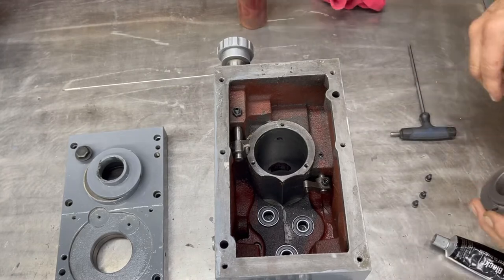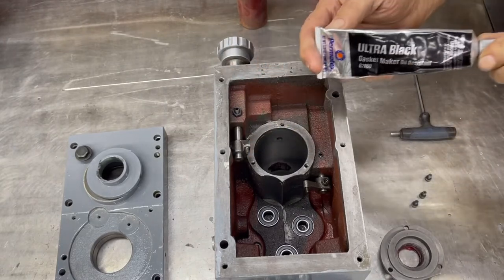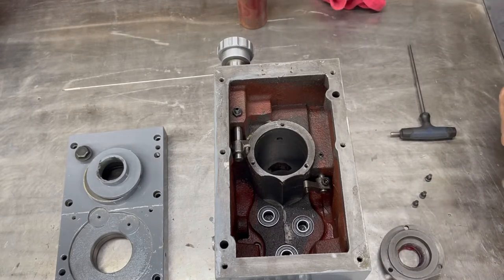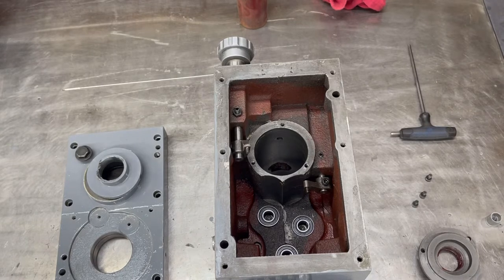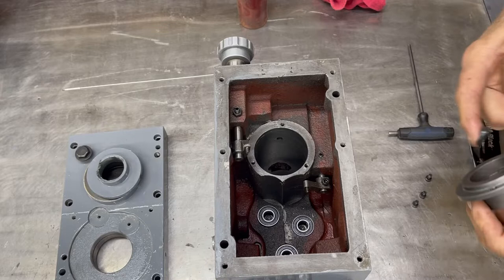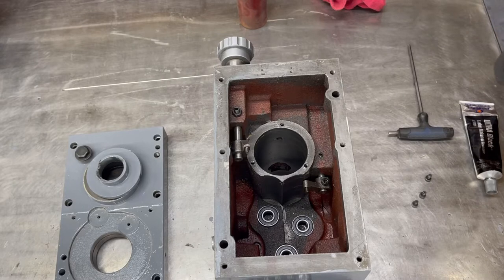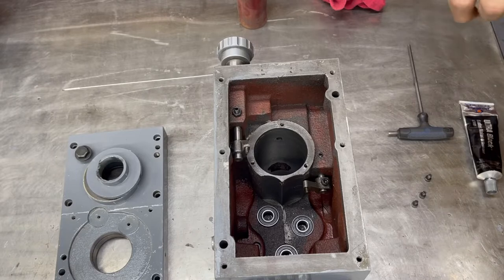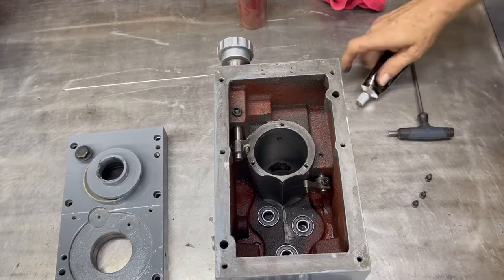Enough said. So, this little critter has a silicone sealer on the inside. Not affiliated with Permatex, but Ultra Black Permatex is the only silicone I would ever use around stuff like this. Engines, car engines. I built a lot of 350 Chevys and used solely silicone for the valley seals. But here it doesn't need a massive amount. Just needs a film. Maybe a bit more. You just want to make sure that the gearbox oil isn't running in between the flange and down into the quill.